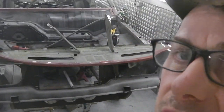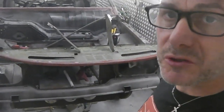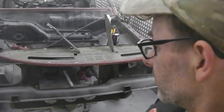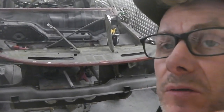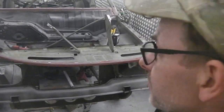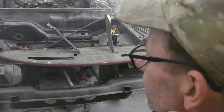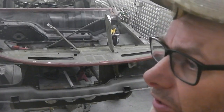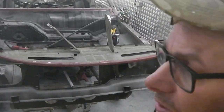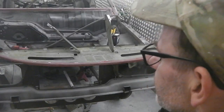This clean metal, this dipped metal, is good because everything works, the welder stays clean. The welds stay clean, and also the spot welder thanks you for it as well, because that can be funny on rusty panels. In fact, there's no point trying to spot weld through anywhere where there's rust. You've just got to be clean, totally clean.